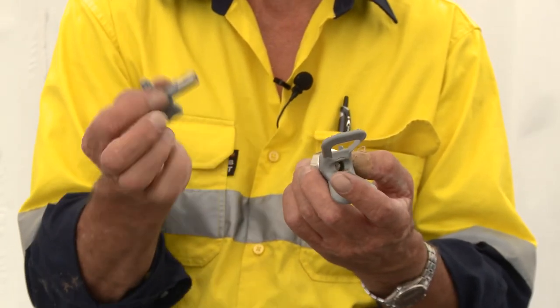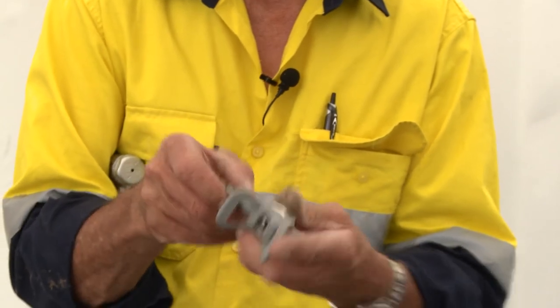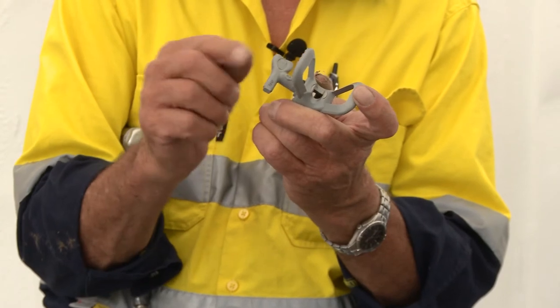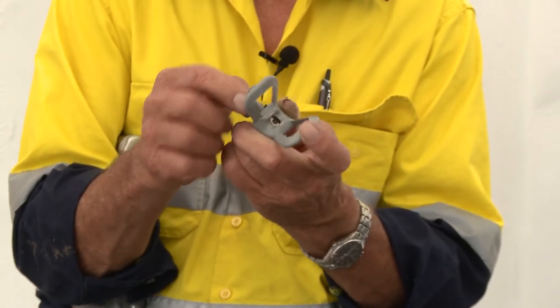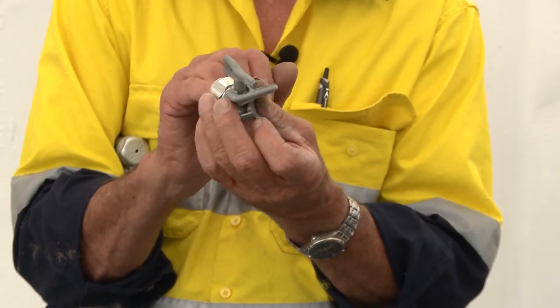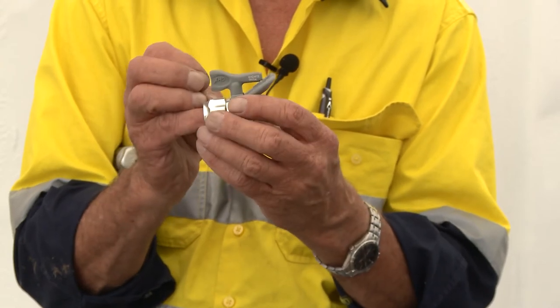Because that is round, the half moon faces into the tip itself. The tip has a cam on it which pushes in the front and pushes around the back. When you put that backing washer in, you have to hold it with your finger to ensure it stays in place before you screw it onto the gun.